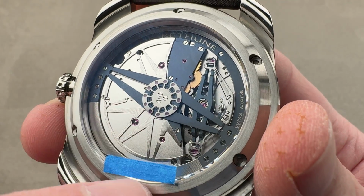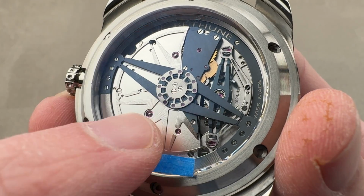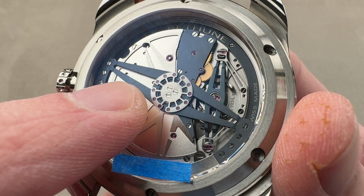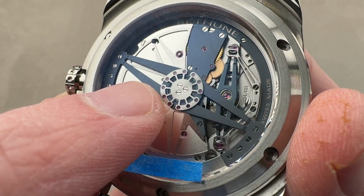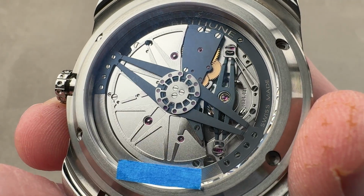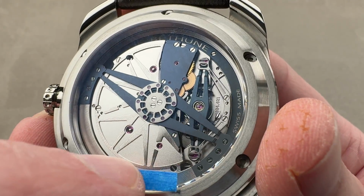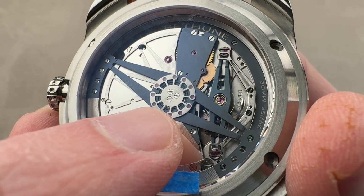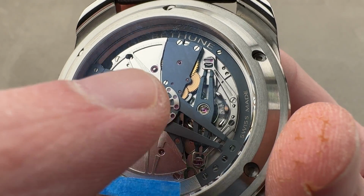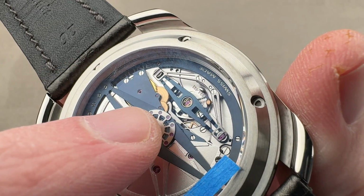So Denis Flageolet, co-founder and watchmaking chief creator from the beginning to the present at de Bethune, decided to create a shock protection system for the ball bearings. So you have 1, 2, 3, 4 cantilever springs to protect from that kind of torsional movement. And then we have little rubies in each one, so when the spring comes in contact with the rotor, there's less friction. We also have 1, 2, 3 shock protection springs for the balance.